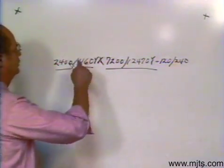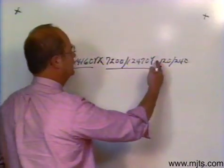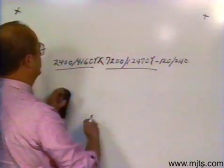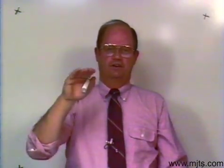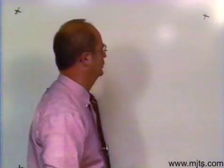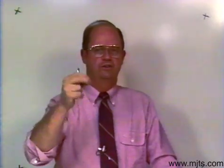So those are the main symbols: the slant denotes same winding, the hyphen denotes separate winding — that separates the high side from the low side. These numbers for the high and low side are what I want to go through to give you the application of the different ratings. On your transformers, it doesn't just put down the coil voltage for you to figure out. You have to look at that rating and understand, by the way it's written, just how that transformer is designed.